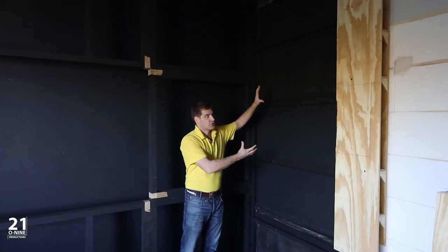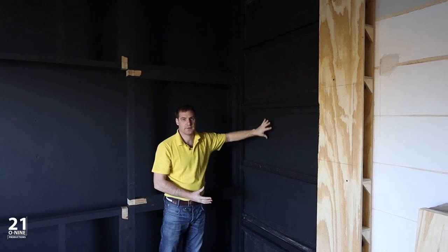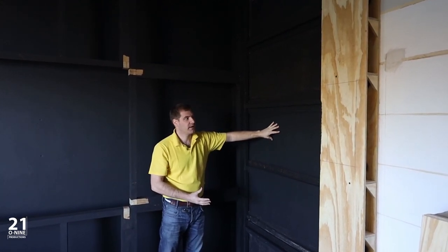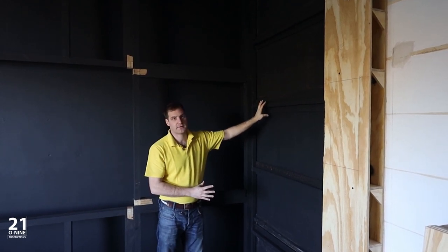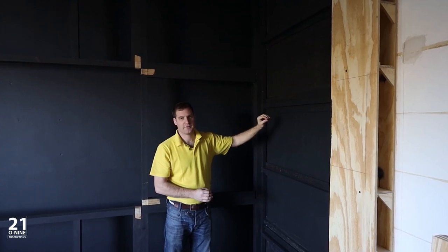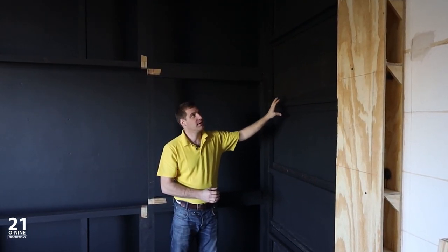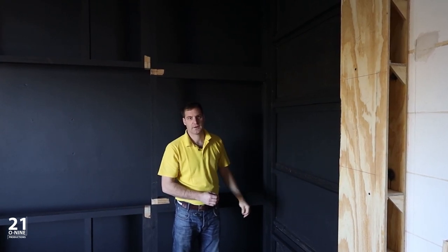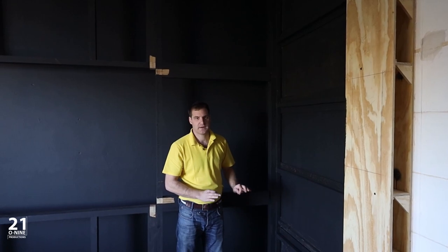On this section of the front wall, we're going to have some mineral fiber acoustic insulation installed in behind the fabric panels. Even though this is not particularly going to be visible, we've painted it black just so that if there are any panels that for some reason don't line up, you don't see any of the treatment behind the fabric. A nice clean look even behind the work that we're going to be doing, trying to make everything as trimmed off as possible.